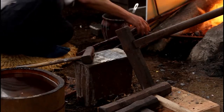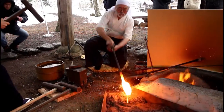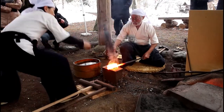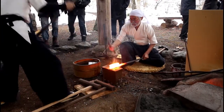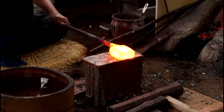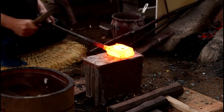The master waits until the metal is red hot before he pulls it out of the fire. He rolls the metal in ash from rice stalks. When he places it on the anvil, he taps his hammer on the anvil. If the apprentice is off target, the master will tap the area on the hot metal, then indicate by tapping the anvil on how much power to use.